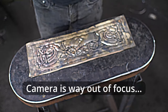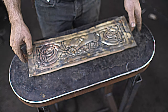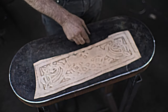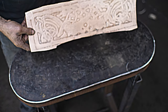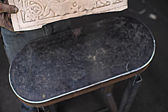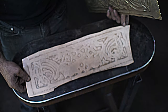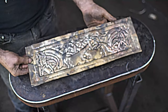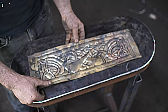I've got my first pass done. I'm going to pull it off the leather now and see the grand reveal. The impression is somewhat there — it's a starting point. I'll put that aside; that was an experiment and I'm not sure if it's going to be a help for embossing leather. This piece is now work hardened, so I need to anneal it — go over to the forge, soften things up, and then we'll be able to get from the inside, push some things out, and get ready for pass number two.